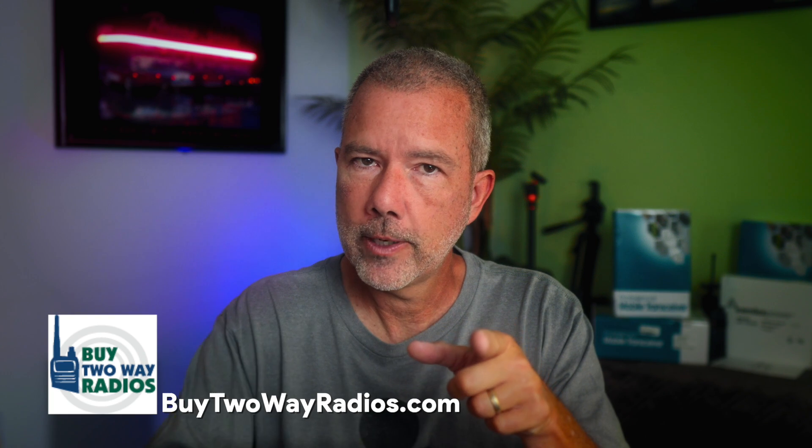So I contacted support at buy2wayradios.com, and they were really good at helping. When you contact support at buy2wayradios.com, you're not just getting some script monkey reading off a script — they're actual techs that know what they're doing. So when I say my SWR is high, they know what I'm talking about. They stepped me through everything to check: every connector, every patch cord. I hooked up different radios. There was the duplexer — remember, for the GMRS repeater there's a duplexer in line. I took that in, took that out. What I ended up doing was testing from the radio, bypassing the duplexer, testing the antenna directly. That SWR was 1.01 — a good SWR. I was actually surprised that I cut it right, because that's a near-perfect SWR. What we narrowed the problem down to was that duplexer.